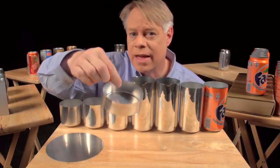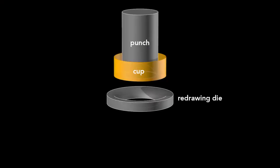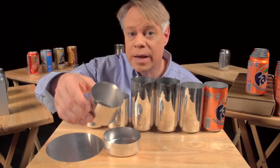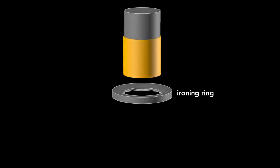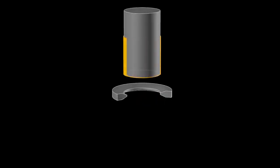The redrawing process starts with this cup and uses another cylindrical punch and a redrawing die. The punch presses the cup through the redrawing die and transforms it into a cup with a narrower diameter, which is a bit taller. This redrawn cup is now the final diameter of the can — 65 millimeters — but it's not yet tall enough. A punch pushes this cup through an ironing ring; the cup stays the same diameter as it becomes taller and the walls thinner. You see the initial thick wall, and then the thinner wall after it's ironed.